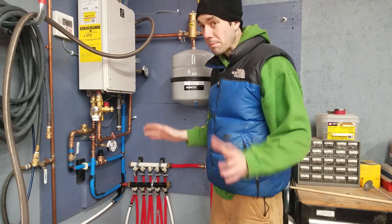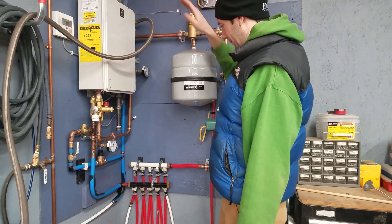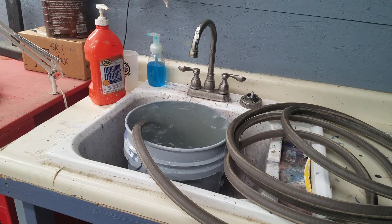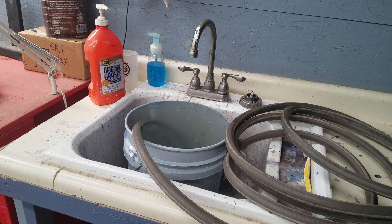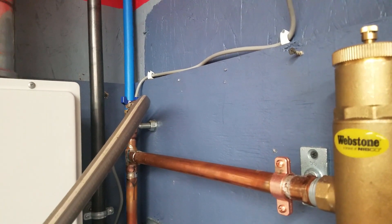With the pumping away system, you're supposed to be able to bleed it very quickly by having this one valve at the top. I'm going to turn this open a little more and I'm getting a lot of bubbles out of there. I've got the valve pretty far open and you can see all the bubbles coming out of the water — that tells me there's still bubbles in the system, so we're going to let this run for a few minutes. Now we're going to turn on the circulator pump. A lot of air coming out.